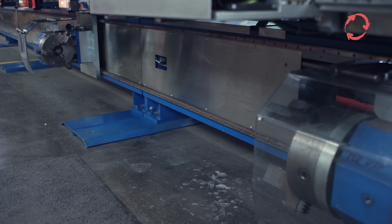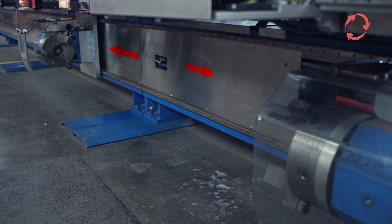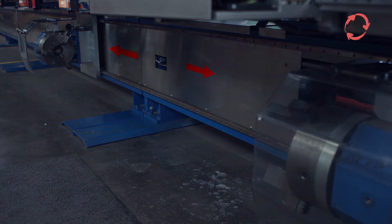The bearing units are used for winding and unwinding, as well as stretching and tensioning of the sieve during the filling process. The user side and the back side of the filling table each have one pair of bearing units, equipped with a drive motor on the pintle wire side, whereas the opposite non-driven unit can be moved across the entire length of the joining table to allow for tubes of varying lengths. The bearing units, which are equipped with jaw chucks, can also be moved laterally so that the position of the uncoiled sieve can be laterally corrected via edge detection during the filling process.